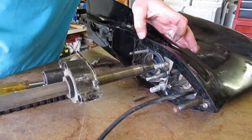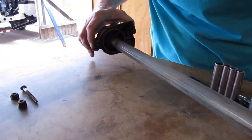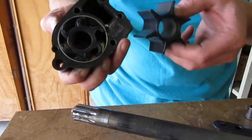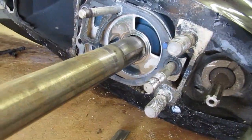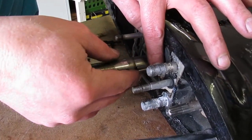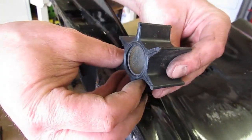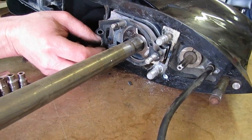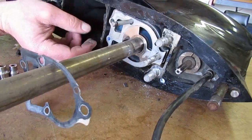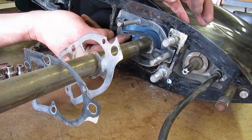This little metal piece fell out — here's the impeller. The replacement kit comes with a keyway that sits flat on the shaft, and it matches to a slot in the impeller itself, so it has to go on in the correct orientation when we reassemble. As soon as I started to remove the gasket material, this one broke immediately, and the next one was on pretty tight so I had to work that one off.